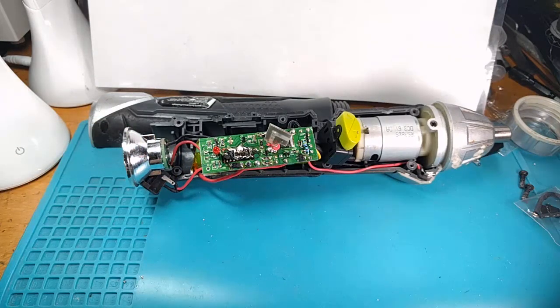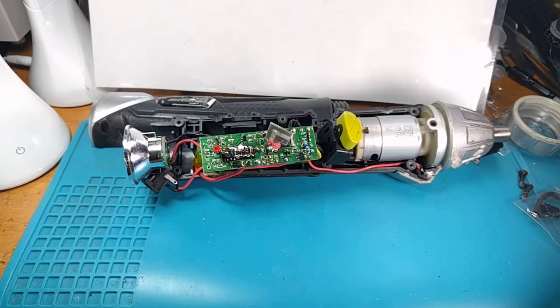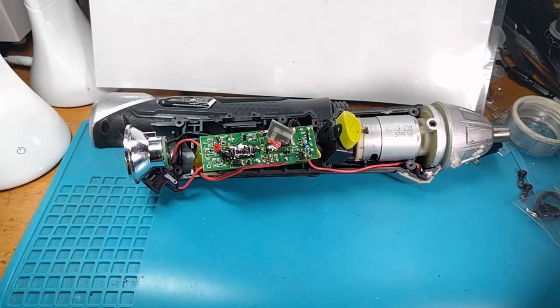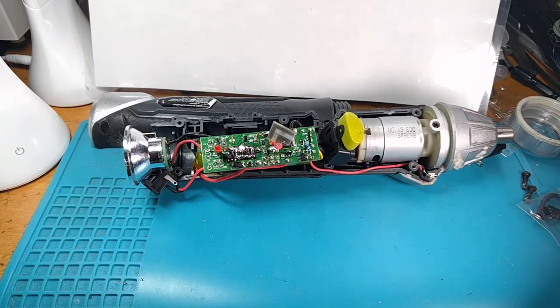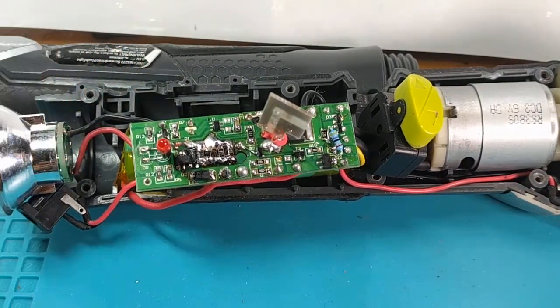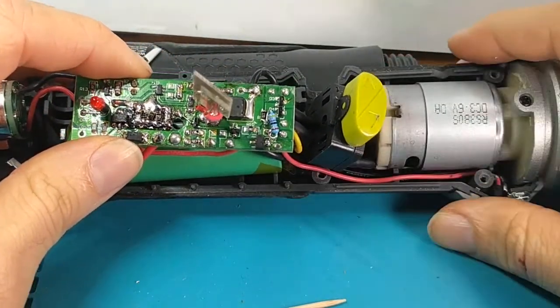These things do take a lot of abuse. The socket is a standard 12-volt socket, even though it comes with a six-volt power supply — six volts at 300 milliamps. It gives a 12-volt reading without a load, which is pretty common for those old-school class-one transformer power supplies. Once you apply a load, it goes down to about 5.6 volts. I want to talk about the upgrades and how this circuit works. I did another video on this, and I like reverse engineering inexpensive stuff because it gives you an idea of how to do things without over-engineering them.